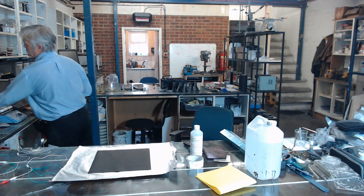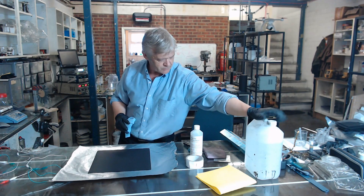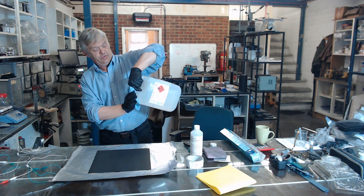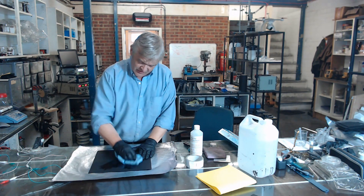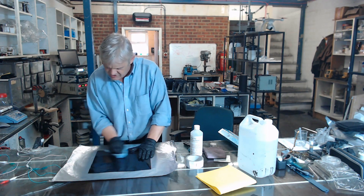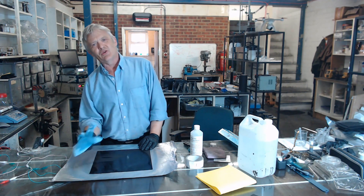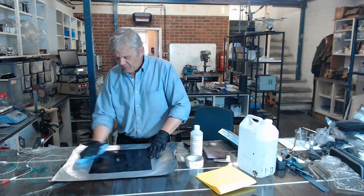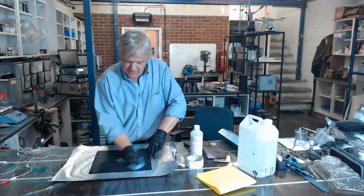What I tend to do is give it a ground plate that I plate on, because then the current across the ground plate is nice and even. I just use a bit of kitchen foil — lay it down, connect it to the negative, and now I have a nice plate with even current density across the surface. All I have to do is rub my metal across it and it's much, much easier.